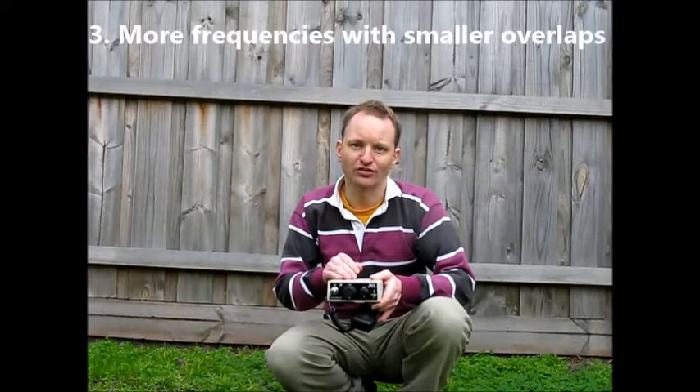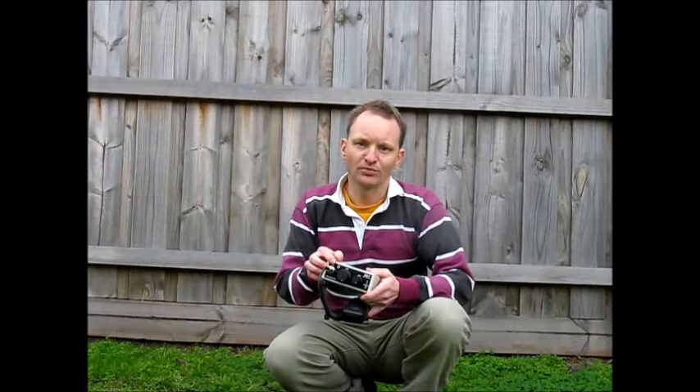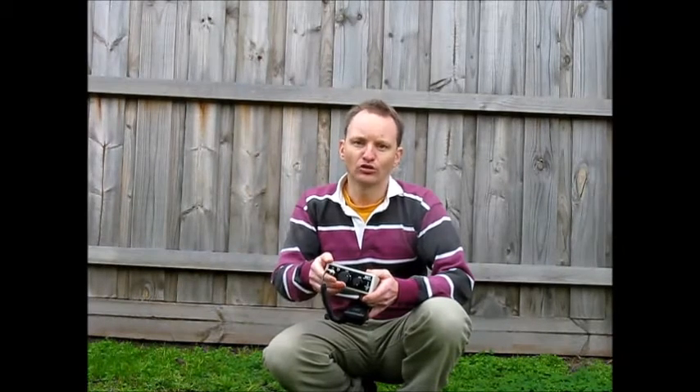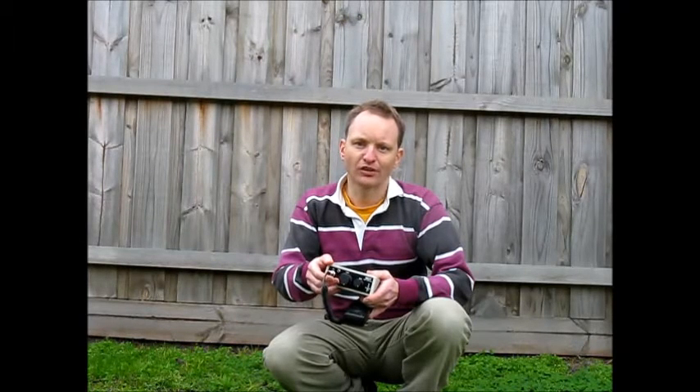When you do the two-range mod, you'll notice that the ranges are overlapping: 7050 to 7110, and 7090 to 7130. More tuning range makes tuning harder, and an overlap is unnecessary. So I suggest having the overlap of maybe 3 or 4 kHz only.